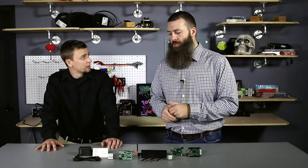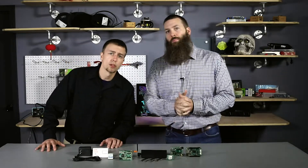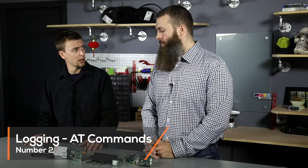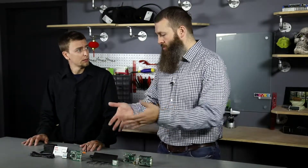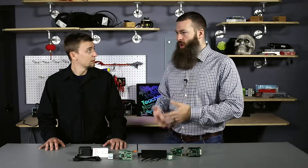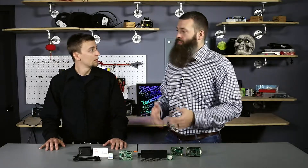If you're building something on a wireless network, you don't necessarily see everything. So logging came up as an important topic. A lot of the communication with the modem or module comes through AT commands. Being able to read those parameters and log that data means that later on, when something goes wrong or the device seems to be resetting, you can look back at what was happening and figure out how to solve it.